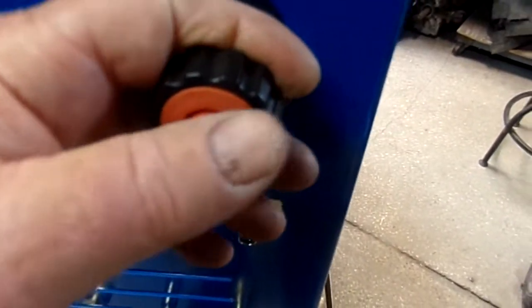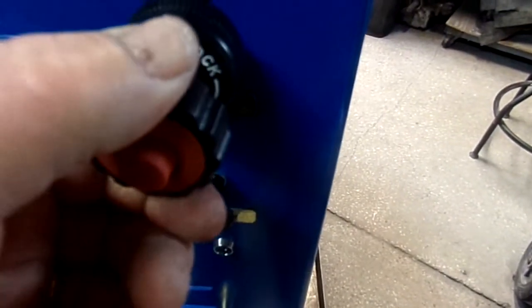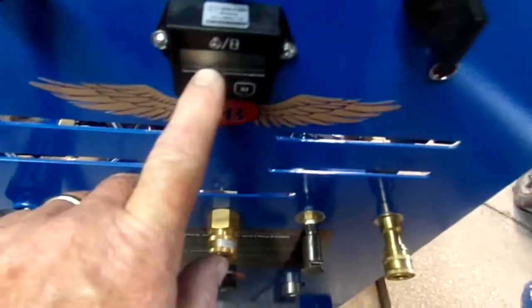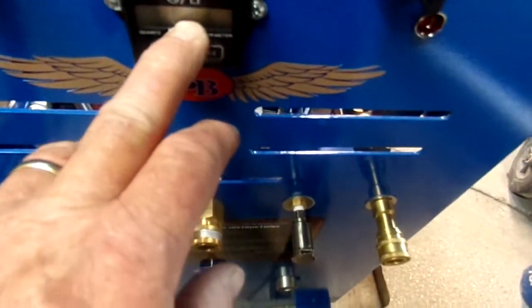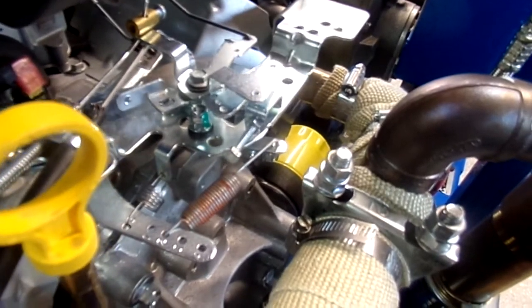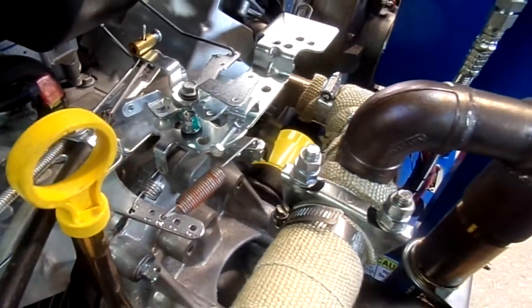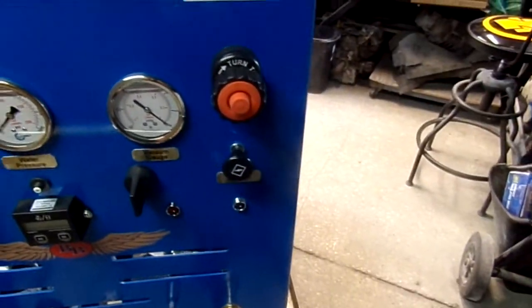The aviator vernier adjuster can be used to adjust micro in the unlocked position. It can actually adjust to a micro range of RPMs, just by moving this to wherever you decide to move it. As you can see, it's very, very finely adjusted. It's not like a T-throttle where it comes out real harsh, hard to lock in and hard to grab.